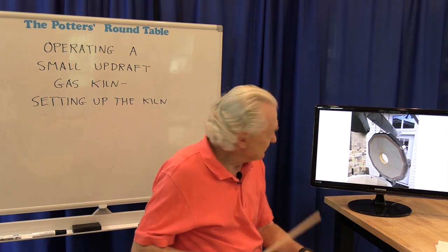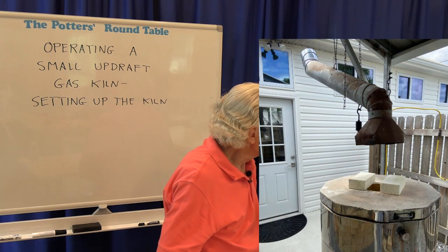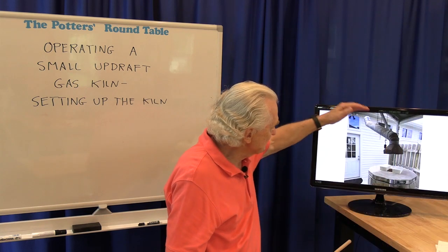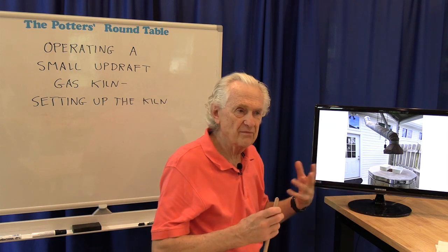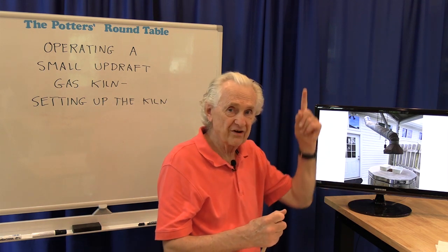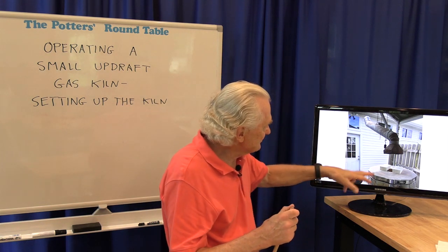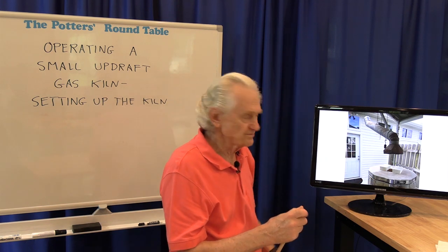The other thing is there's a vent, which you can see partially in this photograph, but I think we have a better photograph of it. We installed a vent pipe over the kiln. During the firing, the vent is lowered. There's a chain system, and I can lower it down. Basically, I wanted to keep the flame, which sometimes can be 3 or 4 feet long, from burning the paint off our really nice new pavilion roof. So this catches almost all of it and gets it out from under the roof.